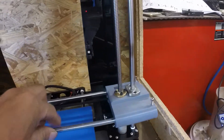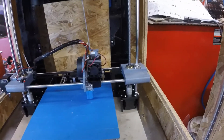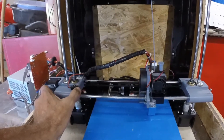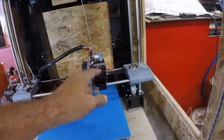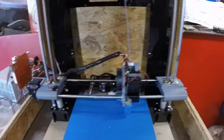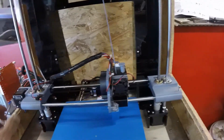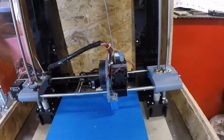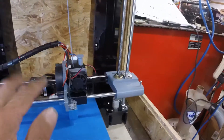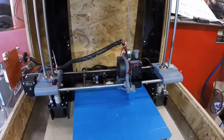You can see how rigid it is — everything is just tightened and secure. This X carriage also moved a few things around; it moved the limit switch over to this side. I have an E3D Titan Aero extruder coming — it's a clone — and I'm going to be installing that, so that's going to change where the limit switch goes. The part cooling fans will probably be moved and the sensors will have to be moved, so that's another undertaking and that'll be another video.